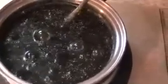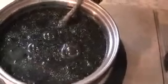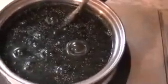You can see approximately the rate of production. We've controlled the rate of hydrogen production by using large granules. We typically use aluminum with granule sizes ranging from 30 microns up to 200 microns, and this aluminum is about 200 microns. The larger particles have a smaller surface-to-volume ratio, and it's the surface area of aluminum that determines the rate at which this reaction produces hydrogen.